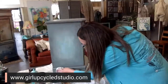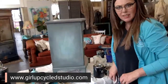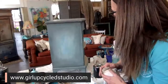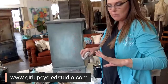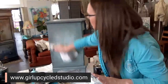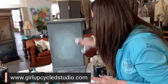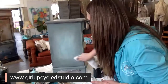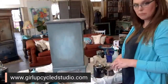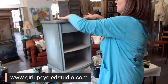Same thing back here. Those waxes are so smooth and buttery. It's still going to dry — it needs time to dry a little bit. Then tomorrow you would come back and just buff it until it has a really nice sheen. Think of it like when you wax your car — you've got to let it dry and then you come back and buff it. Or you could wait at least a few hours — sometimes I start buffing at the end of the day.